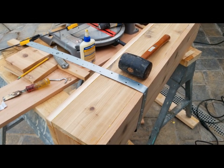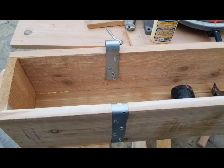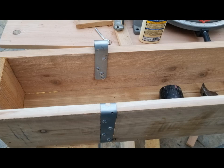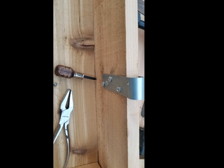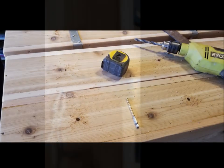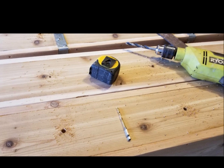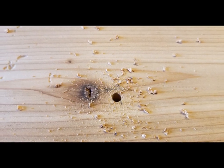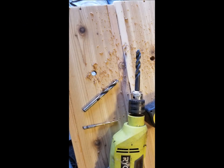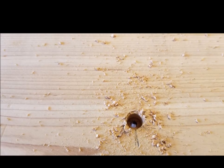These things wrap completely around and then loop over the top. To get the screws inside the box you'll need a stubby screwdriver like the one shown. When you're done, flip them all over and you're going to need to put three weep holes in the bottom of each one for the water to drain out. For any flower box you don't want to hold water — it'll get stagnant and kill the plant. To do that, drill through halfway and then flip the piece over and drill through the rest of the way using a pilot hole.